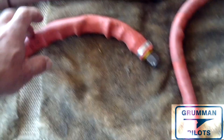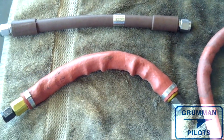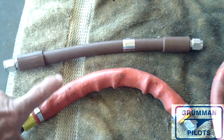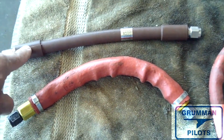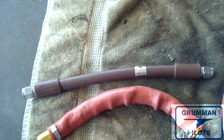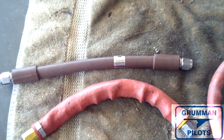Let's talk about variants. Since the original two-place didn't have an oil cooler, you'll have three hoses on the originals. If you've added fuel flow to your two-place airplane, you'll have four hoses. A1Cs that have had an oil cooler added will get upper and lower hoses, usually through an oil filter adapter — typically number eight size, using a three-quarter or seven-eighths inch wrench. The four-place airplanes — both Cheetahs and Tigers — have three number six hoses: mechanical to electrical fuel pump, upper and lower oil cooler. The number four gauges are always number four on both two and four-place airplanes.